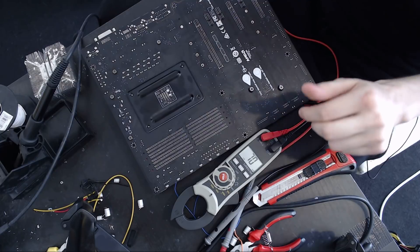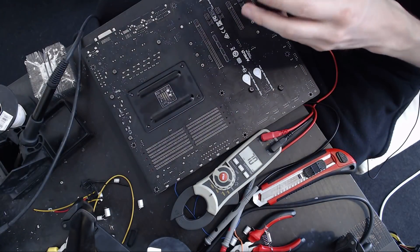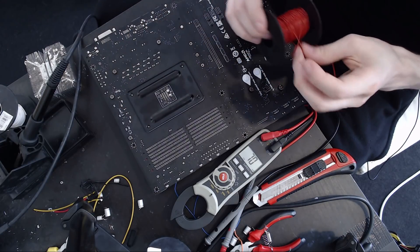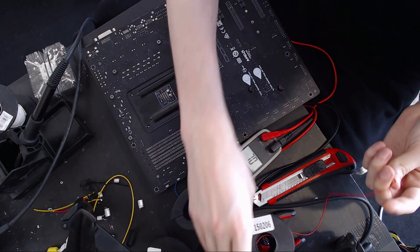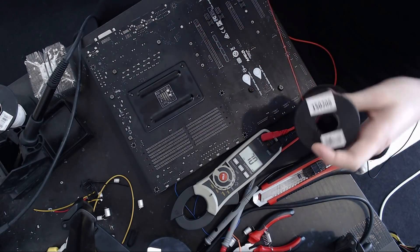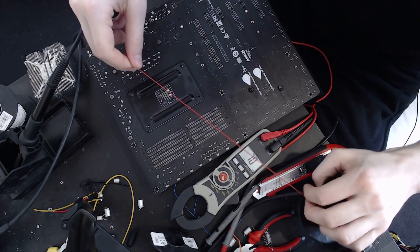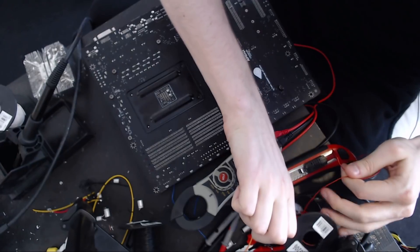Box cutter we have, wire we have, so let's go with red. I won't do the SOC VRM because it's a bit fiddly — I'll just take the reading off of there. The SOC VRM doesn't need to push that much current, so voltage accuracy on it is generally pretty good, because V-droop is relative to output current. How much wire should I use? Just enough to reach while it's inside the board. Let's get the box cutter out.